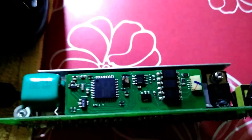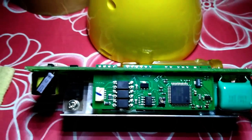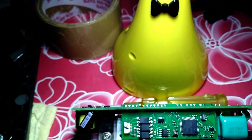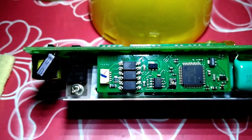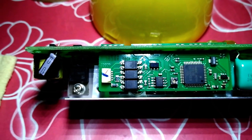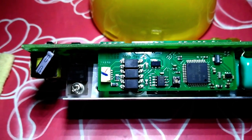The ballast has a digital control circuit mounted vertically with three opto-isolators near the input/output cable. These chips are necessary to ensure that the digital low voltage from the motherboard doesn't mix with the high voltage present in the rest of the ballast. We can observe that two opto-isolators are facing the left side and only one is facing the right side. This right-facing opto-isolator is the output that sends a signal to the main board to indicate that the lamp is operating perfectly fine.